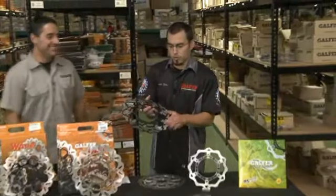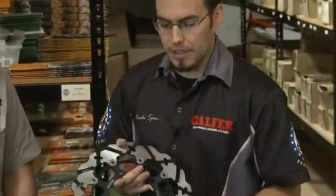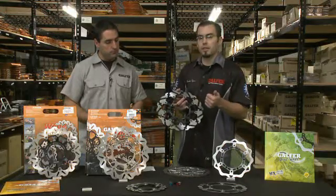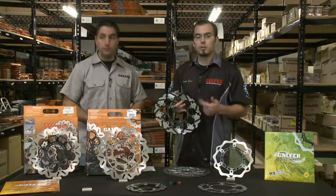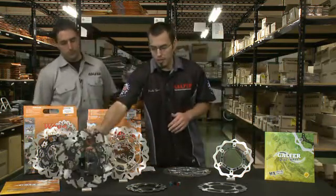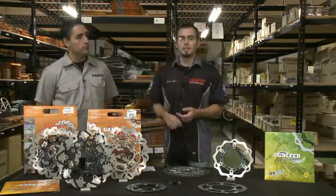Going back into our Superbike rotors, one of the other benefits of this design is that among all of the processes that the rotors are put through, whether it be the laser cutting, the heat treating, or the double disc grinding, we also put the Superbike rotors through a cryo treating process. The reason for that is, again, it helps temper the metal for warp resistance, and it gives you a better, more consistent material by redistributing the material of the rotor itself.